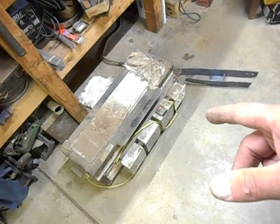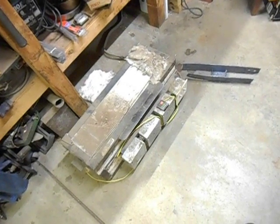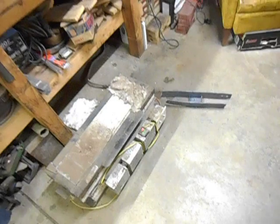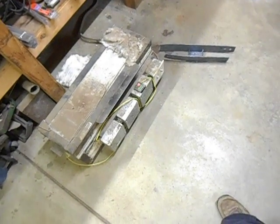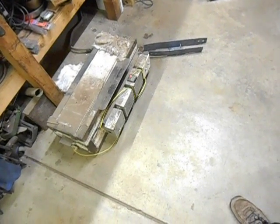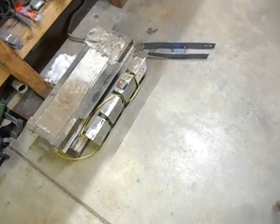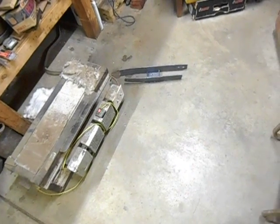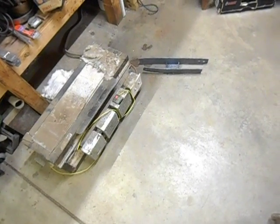As soon as I started annealing in the kiln instead of the wood ashes, boy, I threw those wood ashes away and did a little happy dance, because I was constantly having to sweep up the ashes, and you'd put a blade in there too fast and you'd have a whole cloud of ashes come up in your face. It was just horrible, where these kilns are really, really nice for that. I still do have to use the vermiculite to anneal my big choppers that won't fit into this kiln, but I only do a couple of runs of those a year, so for the amount of time that I'm doing on that, I'll just keep using the vermiculite instead of having to build a 4-foot long 220 kiln to be able to anneal those.